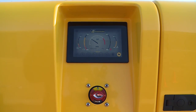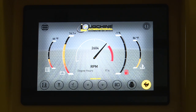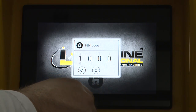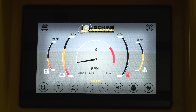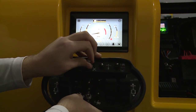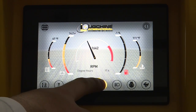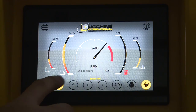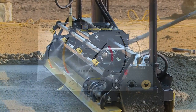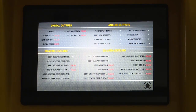Perhaps one of the most exciting features of Screed Saver Boss is the fully integrated Parker display that is continuously monitoring every function of the machine. Display features include our password-protected keyless machine anti-theft feature, remote start and stop from either the display or the wireless remote control, engine RPM adjustment and total machine status feedback at all times, engine hour and job hour tracking, spray bar switch with fully automatic on and off activation via boom position, and sophisticated diagnostics displayed down to the individual hydraulic valve functions.